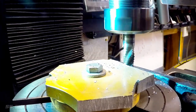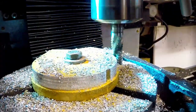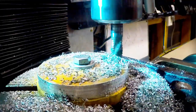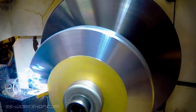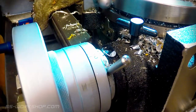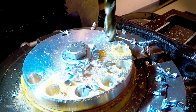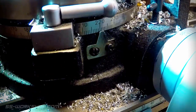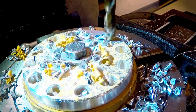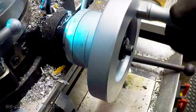The final part is the locating wheel, which I'm cutting out of some 12mm aluminium plate using the rotary table on the mill, with a bit of WD-40 as cutting oil, and a 12mm cutter. Once the plate's roughed out I take it over to the lathe to clean up the face and outside diameter. Then it's back to the rotary table on the mill, where I drill 8mm holes every 30 degrees around the plate — these will be the angle stops for the rotation. Once the holes are drilled I bore out the centre to allow a closer fit, leaving about 6mm left in the bottom.